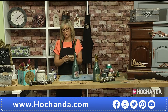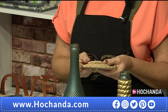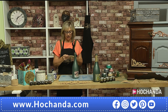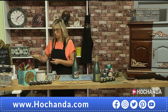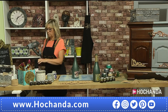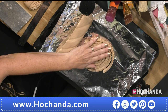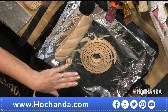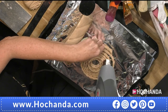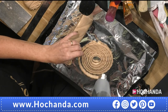The moldings are made from wood so they have all the same properties — you can paint them, wax them, stain them, even drill them. Most excitingly, you can bend them. Just warm it on the griddle with a little more heat and pop it onto the piece. You don't even need a heat gun — you can just use a hair dryer at home. Can you overheat it? Just be careful not to set light to them.